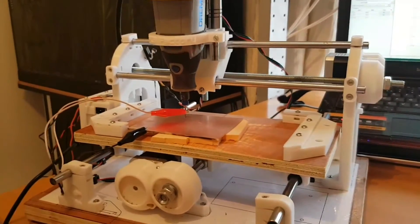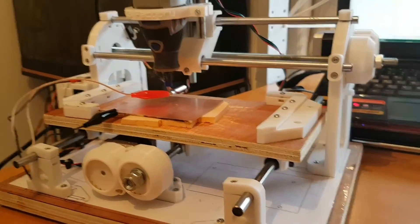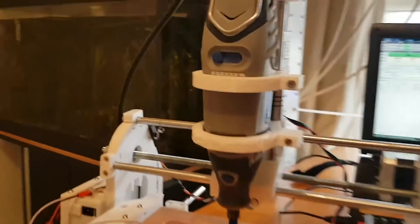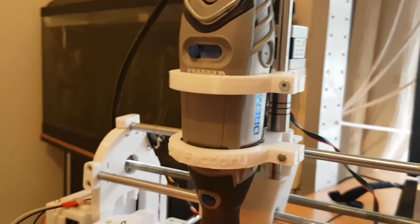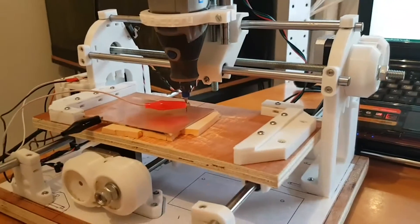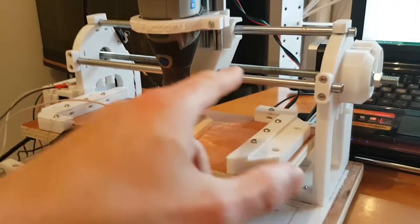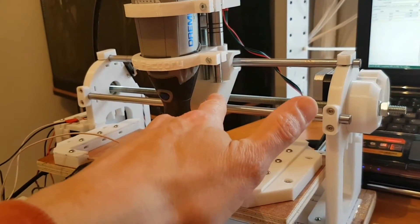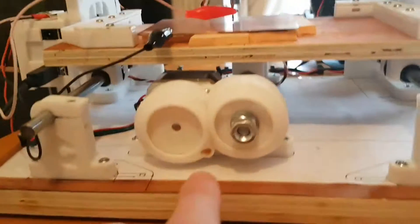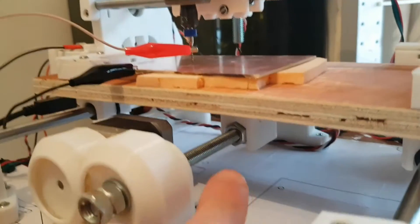I am going to do a detailed sort of write-up of what I have found on this hopefully, but in the meantime this is fully printed - that's a Dremel 3000. It's printed at 50% infill with at least 1mm thick sides; these take about 10 hours each. Something like that would take about 2-3 hours. All the cogs are printed. That's just threaded rod.